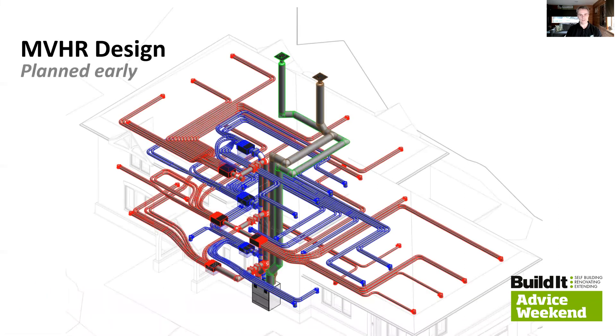Here's an impressive system in a 400 square metre property over three floors. It's got a light commercial unit in the basement capable of 900 cubic metres per hour. The main thing is it's got risers that run through the entire property through all the floors, which means we can have the unit in the basement and vent out to atmosphere through the roof — ideal both ways. It's a fire-safe masonry riser that runs through all the floors, created for us by the main contractor and the architect.